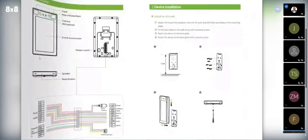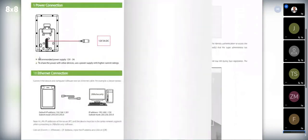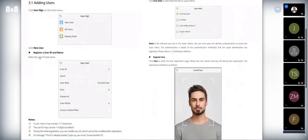Here are some wiring diagrams. You can wire a lock directly to the reader or send a Wiegand output to a third-party panel. It has auxiliary inputs and outputs, so you can wire an alarm, an exit button, or a motion sensor. On the reader's interface, you can enroll new users directly — and you can also enroll users through the software when using it with software.